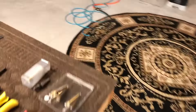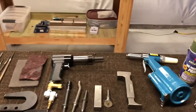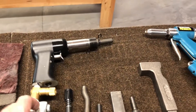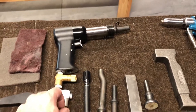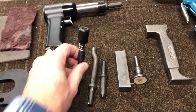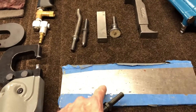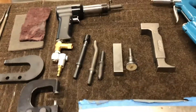Moving back over here — now we move on to assembling and riveting. You'll need a rivet gun; this one has a swivel on it. It's okay, I don't know that I really need it. You're going to need a bunch of different tips for it. This is a back rivet set — it goes in conjunction with this plate. I really like the back rivet sets; it makes it easy to drive the rivets in.